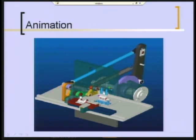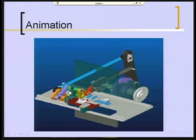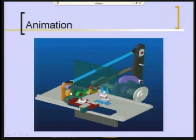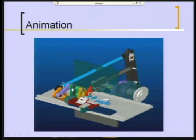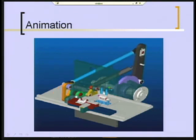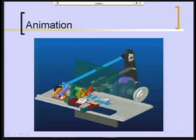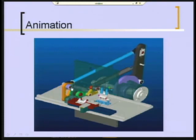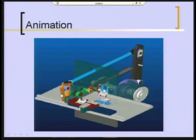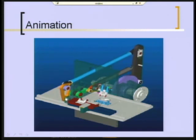So what they did was replicate link 6 on the other side of this base plate. You'll notice there's a twin to it over here. The base plate is put in transparent form so you can see through it. So you can see the other piece of link 6 over here. Really the same link, it's just split across the base plate. And that link 6 is also obviously going through the 141 degrees. The purple one is what we call link 5, the connecting rod for the drag link mechanism. The orange one is the driver of the drag link, which we call link 4.